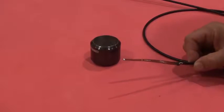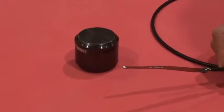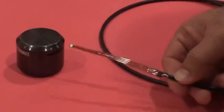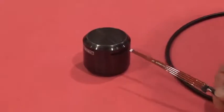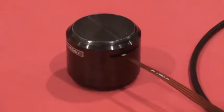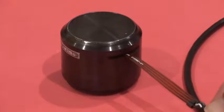The ultra thin probe is also a transverse probe. It has a particular application when we have a very narrow gap, like this reference magnet. The gap is very tiny, so we could use the ultra thin probe to mount it inside that gap.